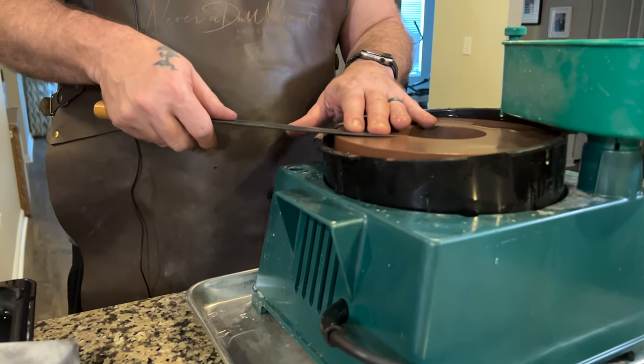If you're not an expert polisher and you wanted to take some sandpaper and make that better, you could. If you wanted to practice polishing, you can. But remember — even though we made it thinner, we didn't technically put an edge on it, so whether we want to go through the process of getting a burr or turn on our machine, all of this equipment is your best friend. It's not necessary though — if you have one 1000-grit stone and needed to thin your knife, you could do it. It just takes time.